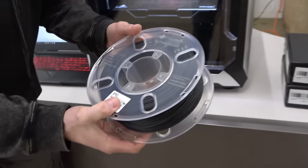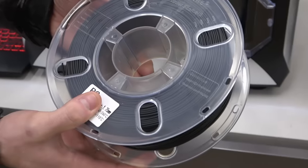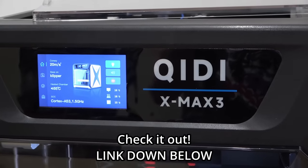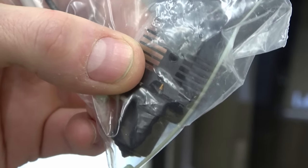We've got some much better filament to try — polycarbonate carbon fiber. This stuff has tiny strands of carbon fiber embedded in it, and polycarbonate in general will deal with the heat much better than PLA. Our secret weapon is this Qidi Tech X-Max 3 — I've had it for about a month and absolutely love it. It really excels at hard-to-print stuff like polycarbonate. It's got a heated enclosure and a dry box in the back, because polycarbonate can absorb moisture from the air, which will totally screw up a print. It also comes with a hardened steel nozzle, because carbon fiber filament will just chew up copper or brass nozzles.